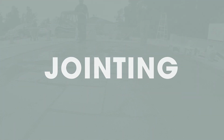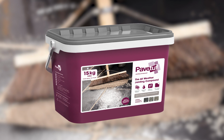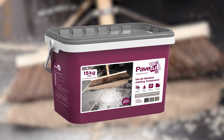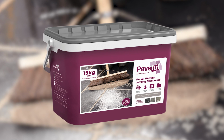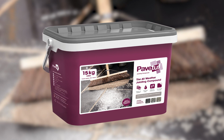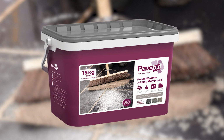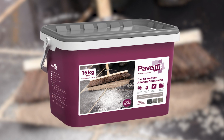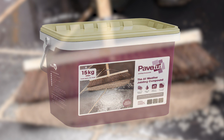So once the paving is done, you need to grout the joints. We always suggest using Pave Tough jointing compound with all of Natural Paving's products. This really is the best option for the job. It's an easy-to-use brush-in sand, and you can use it come rain or shine, so you are always able to fully complete the install and don't have to wait for a dry day. The jointing compound is available in a gray or buff option. Please be sure to read the instructions on the tub before use.